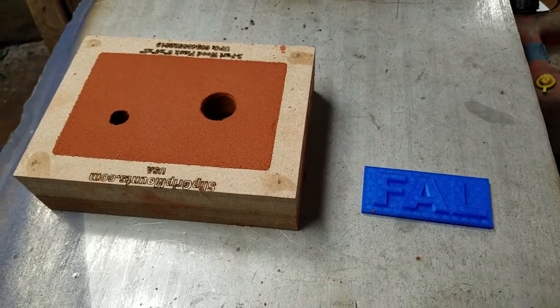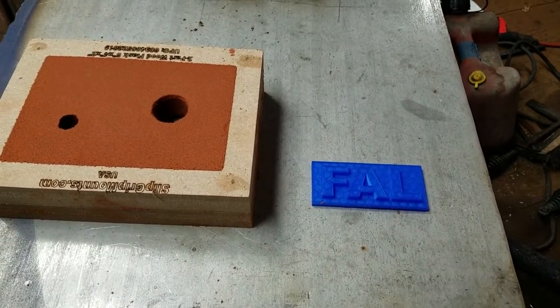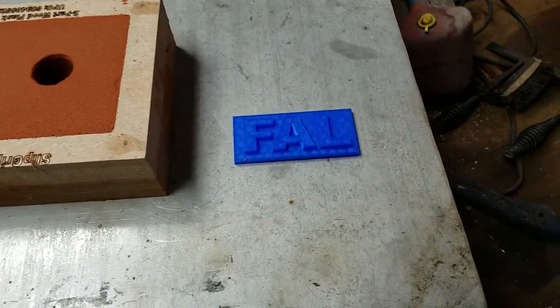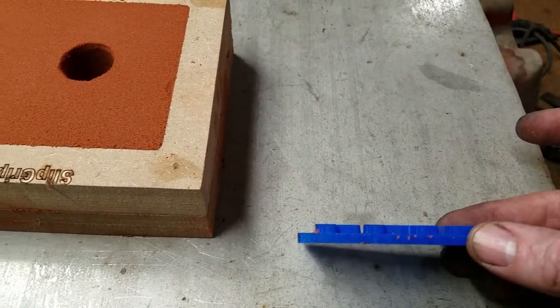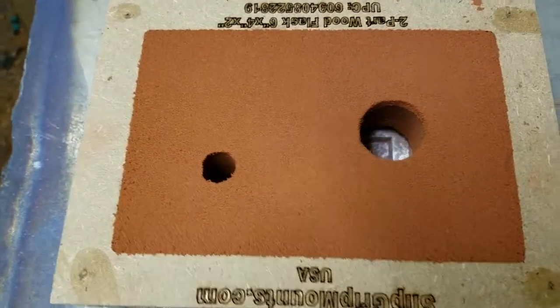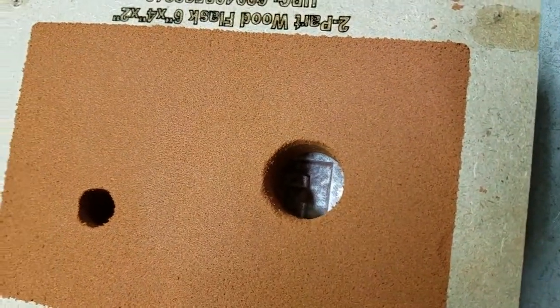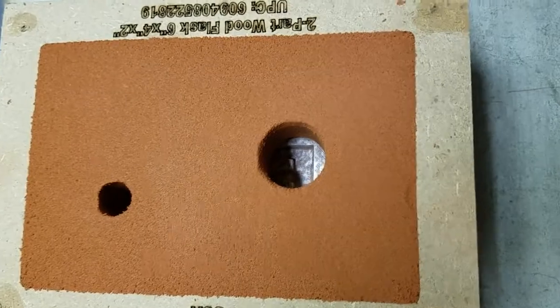Tonight's mission is going to be casting something that looks like this out of brass. I've taken this and printed it on a 3D printer — it has a slight taper to the text which is nice. I then coated that in baby powder and set it in the other half of this form. I'm not going to take it apart because I'm a little worried about it being fragile, but you can see down in there the reversed image of the thing.